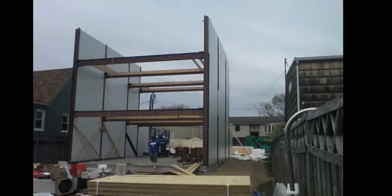Here we are almost done with the walls. You see how the floor system is basically a member that's bolted to the red iron and then standard floor 2x10s in a joist hanger. So that part is efficient. This is a three-story, 35-foot-tall home.